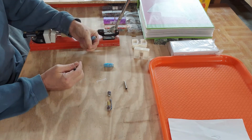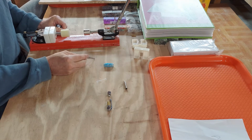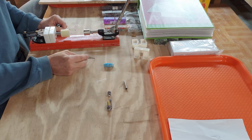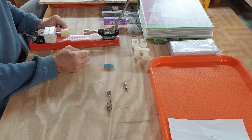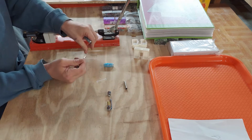Springs. You're not going to pick this up on camera probably. On these nib springs, usually there's a narrow end and there's a wide end. If there's not, and if the spring's uniform on both ends, look at the number of wraps on the end. You want the most wraps and the widest end to be what seats against the nib.